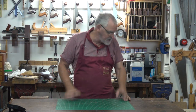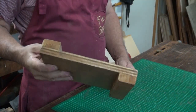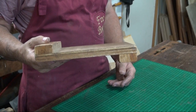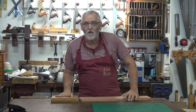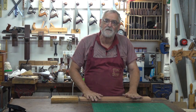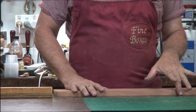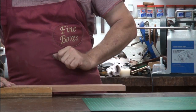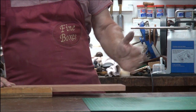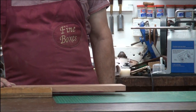So the first thing is, you knock yourself up one of these things - a bench hook. Very easy to do. You've mostly got the scrap lying around the shop floor that you can use. The reason I like using the bench hook is because if I'm cutting timber on the bench and I cut through, I'll mark my bench. So if I've got it up here, I've got an air gap underneath there for the saw to rest. And if you like, you can put a little bit of sacrificial plywood under there, or put a mat under there, something like that.